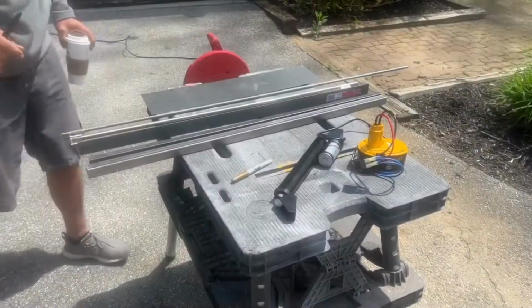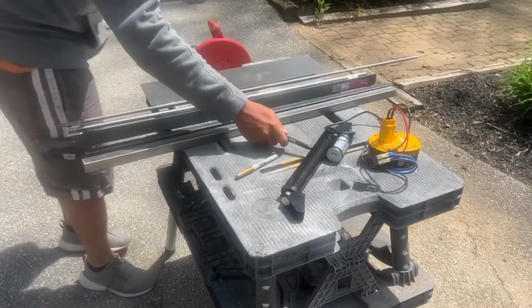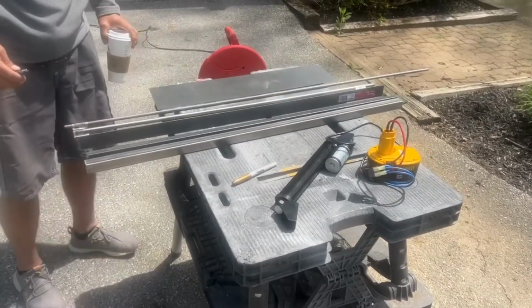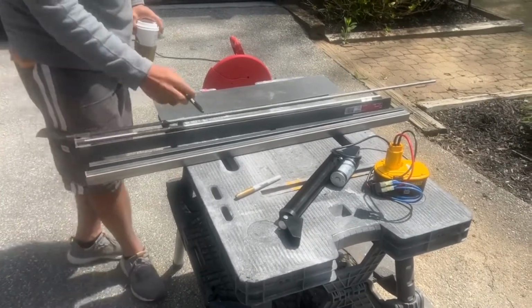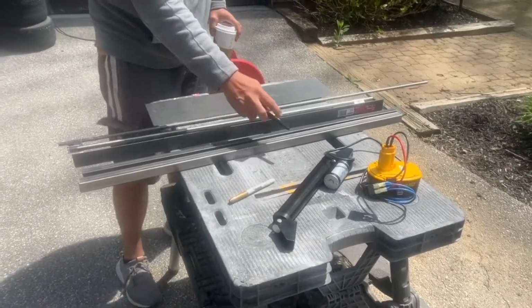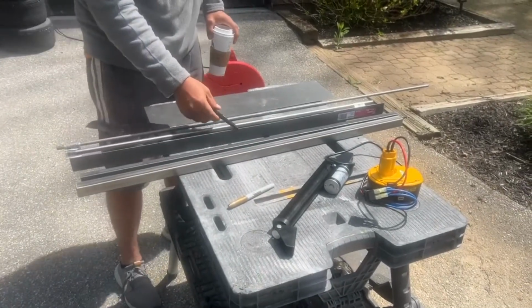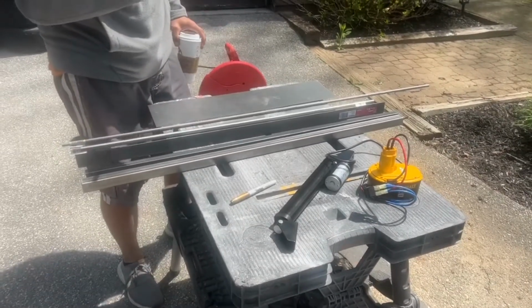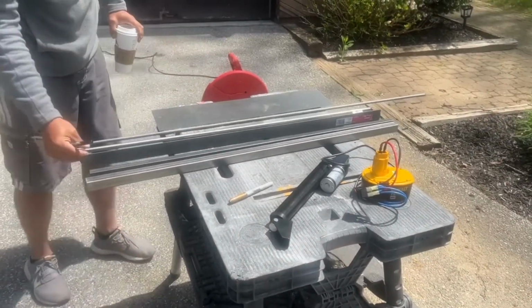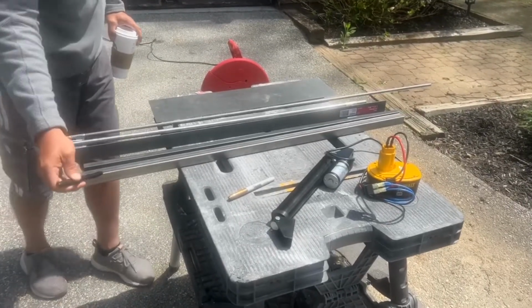What we're trying to do is create a ceiling mounted linear actuated TV mount. We're going to do that by using the L channel here, probably about 22 inches deep, because this is a pretty long actuator. I might have gone a little too big, but 22 inches, using the L bracket to mount it up into the ceiling rafter, where we'll use the round bar to create a hinge in the front that'll connect the square tube.